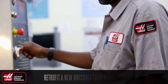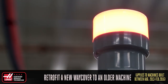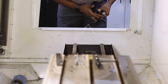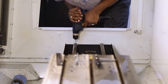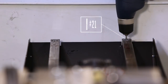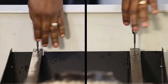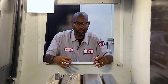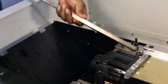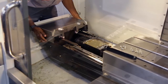Jog the X-axis all the way to the opposite end of travel and put the machine in e-stop. Remove the old X-axis wiper cover and L-bracket. Locate the two holes on the wiper mounting bar. If the holes are not drilled all the way through, use the number 21 drill bit to break through, then use a 10-32 tap to tap the holes all the way. With the holes drilled and tapped in the guide bars, remove the guide bars from the machine, install them in the way cover, and then install the way cover and guide bars on the machine as an assembly.